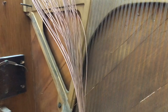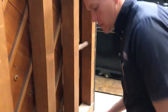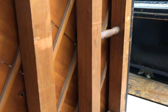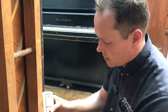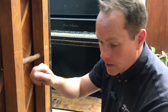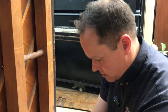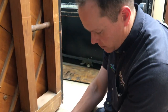After I put glue in there I'm going to drive the screw with a screwdriver, not with a drill - I'm not going to put a Phillips bit on the drill because I want to feel it and I want to go very slow. This is such soft wood that if you were to use the drill it would very quickly strip. Let's see if we can get glue through this needle.